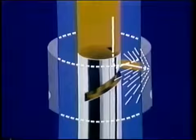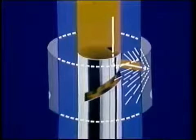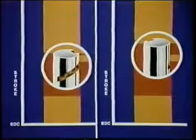Whatever the helix, in the P pump you'll find a baffle sleeve around the barrel. When high-pressure fuel first spills, this sleeve keeps fuel from striking and eroding the aluminum pump housing. As on all pumps with a helix, when the spill happens sooner, as on the left, you have a shorter effective stroke. Compare that to a later spill, which gives a longer effective stroke.